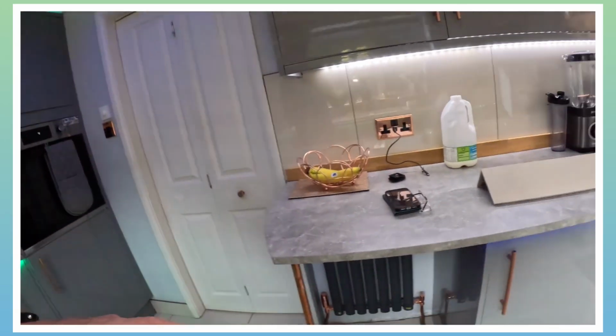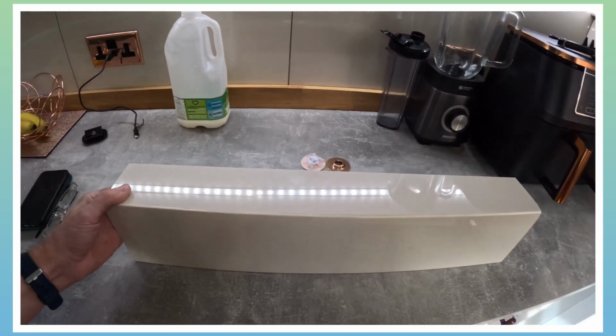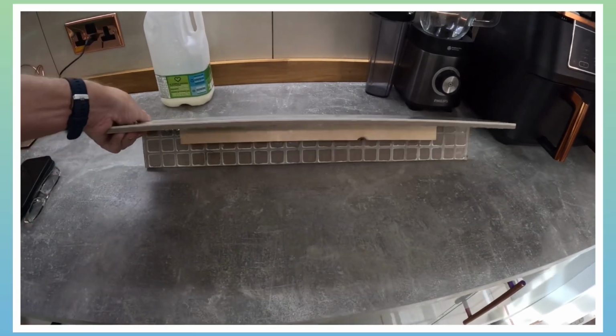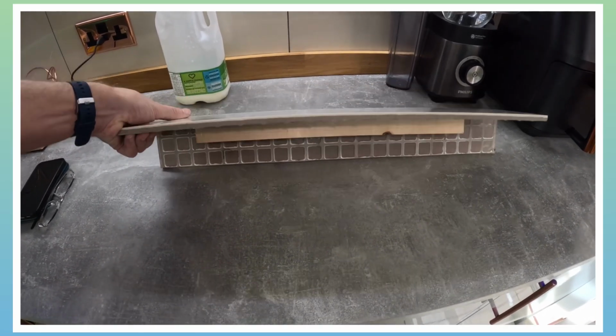Mine's a Vaillant boiler, 3 years old. So I've already drained down, I've cleaned the magnet filter out, I'll show you that in a minute, and I'm going to just remove the radiator, and then I'm going to fit my nice boxing in that I've done with the resin mitre. Came out okay, nice and strong. So yeah, I battened it there and filled it with resin.